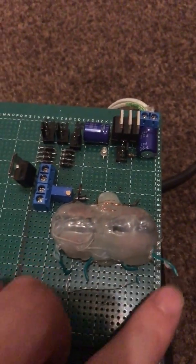This is my transistor — a high-frequency transistor which helps make this a flyback circuit. I can control it with this variable resistor depending on the voltage; I might have to fine-tune it. It goes to my transformer which produces the arc. I need to cool this down since my transistors are completely burning up after about 10 seconds of run time, which is not ideal for an ionizer that's constantly plugged in. The high voltage output is around 9 to 10 kilovolts, and that needs to go through the diode-capacitor system I previously mentioned.